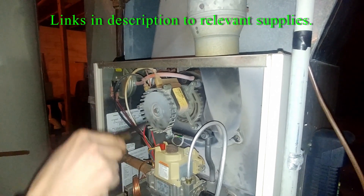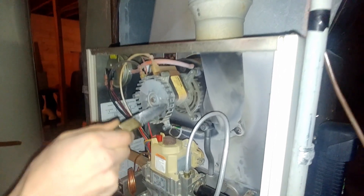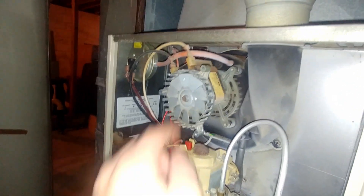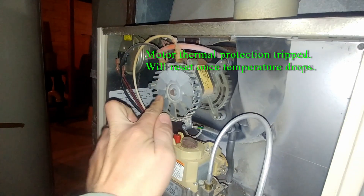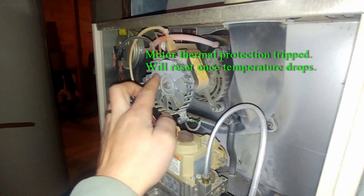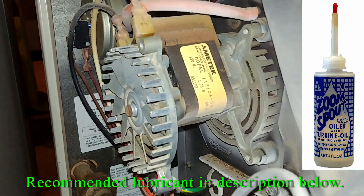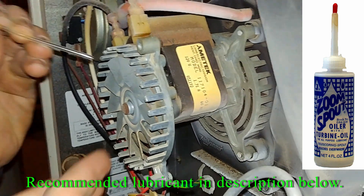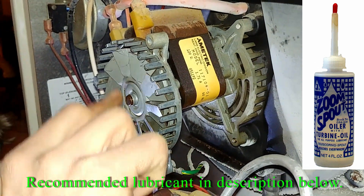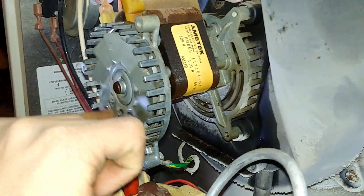In the short term, if you need to get your heat going, you can spend some time trying to oil this motor. They're not really designed to be oiled overall, but we were able to take that cover off and turn a lens here, which allows us to slowly inject lubricant into the various areas where it needs it. Using a type of oil like this one I'm showing here is better than using something like WD-40 because it's thicker and will last longer.